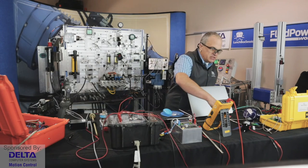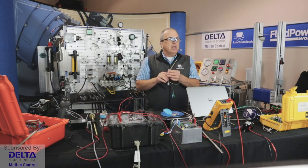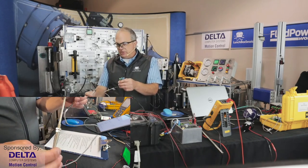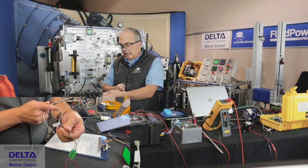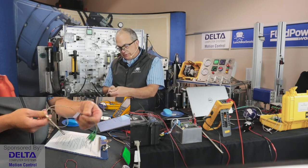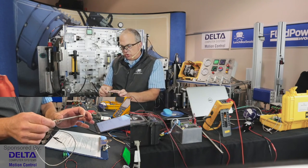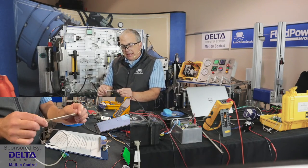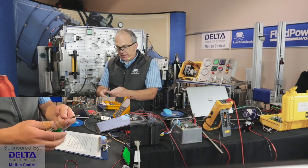And a very common device for getting that type of work done is a device called an RTD. Well, they come in lots of different shapes and sizes. This one is an RTD that is a PT100, a category of RTD, resistance temperature detectors. Typically, this probe would be inside the fluid that you wish to measure, so right inside the tank. Sometimes it's in a well, and so a spring on the end helps keep it in contact with the end of that well, because there may be a bit of an air gap.